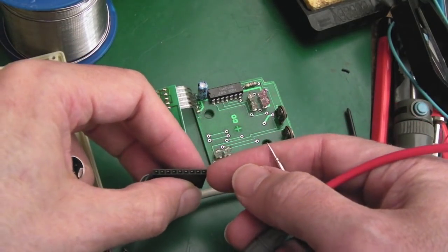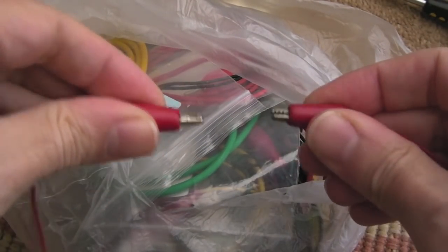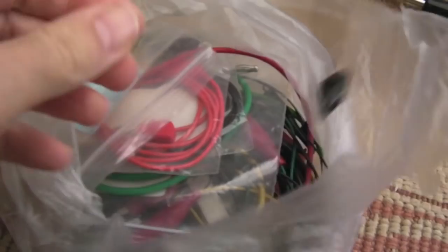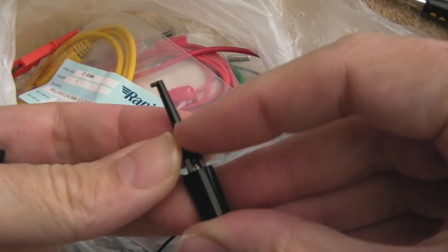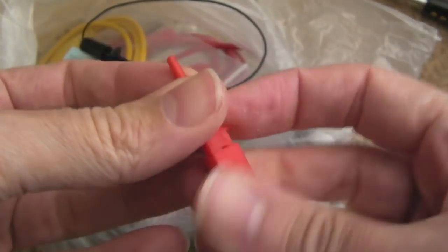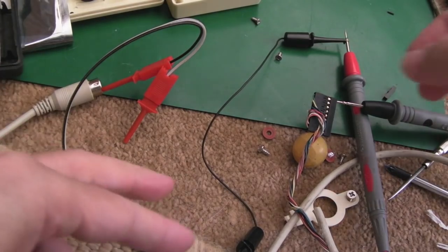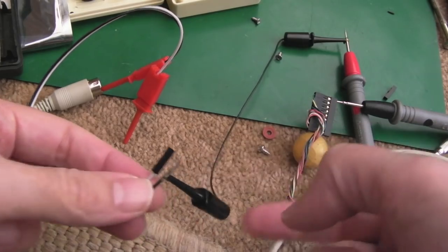What I might just do is stick a pin in there and use a crocodile clip to connect to the pin so that I've got a reliable connection. When you're doing anything electronics, it's always nice to have some short-length cables with croc clips on them because these will assist you in so many different ways. You can buy the croc clips separately - just search for croc clips on eBay, you'll find loads. The smaller micro ones are useful - I can just carefully hook that onto that single pin and then connect something to the other end.